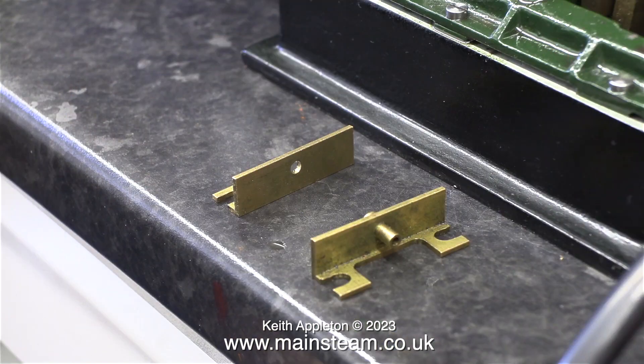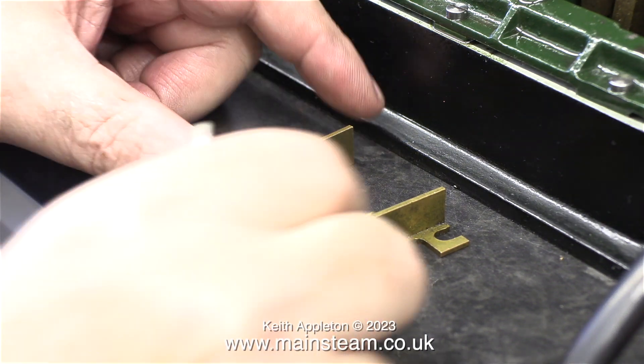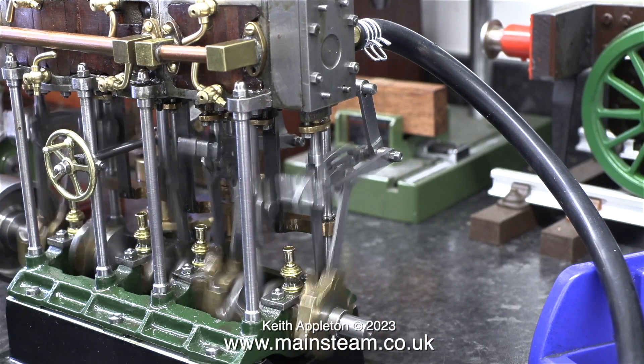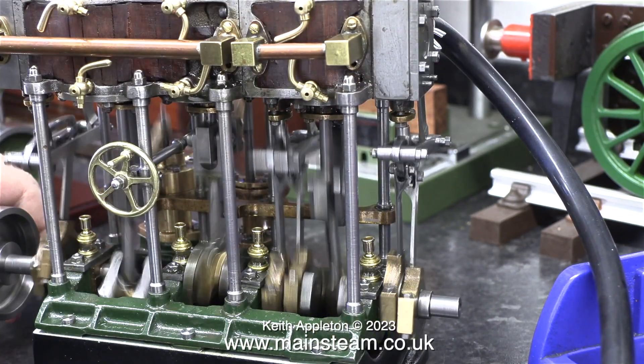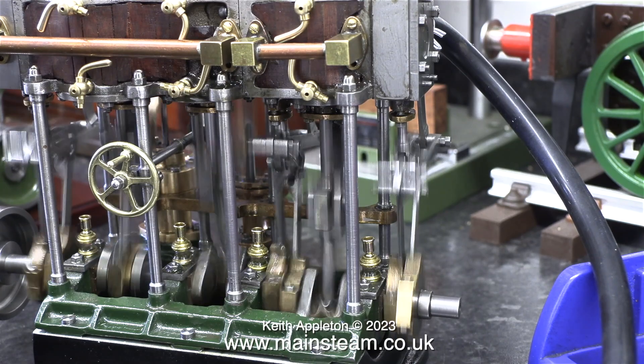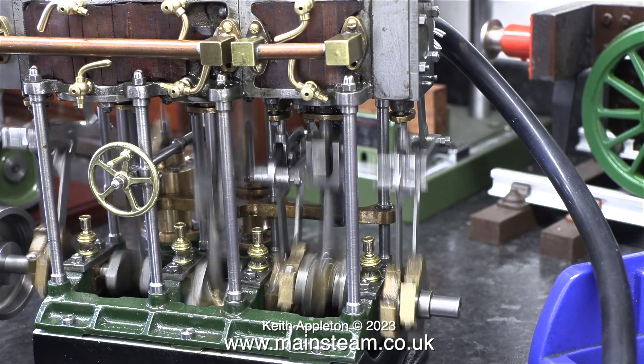This was a temporary simple jig that I made when I was timing the intermediate cylinder, so I know that the valve timing for this cylinder is correct at both ends. When I fitted the second pipe between the intermediate cylinder's exhaust and the inlet of the low-pressure cylinder, the engine became much smoother and more powerful.